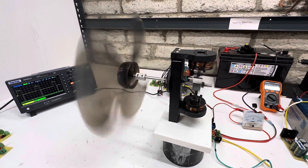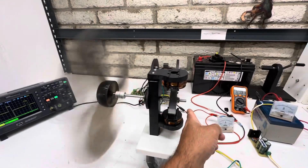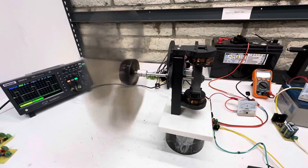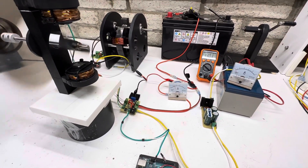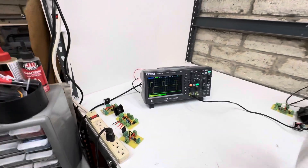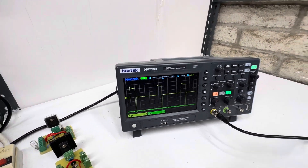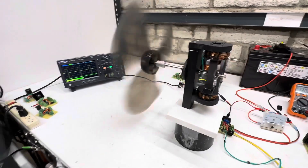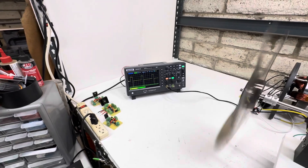Partially because this is just a test bed and I don't have a bearing on this side. We're at a little bit less than an amp and a half. Here's the waveform now — it slowed down a little bit and got a little bit wider. But yeah, it runs really cool.